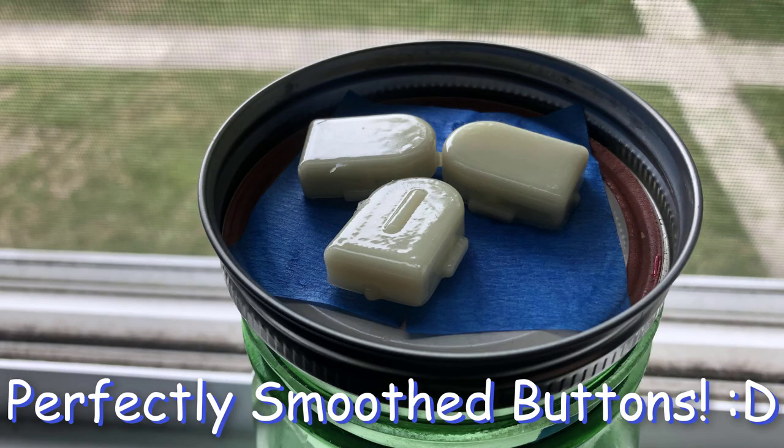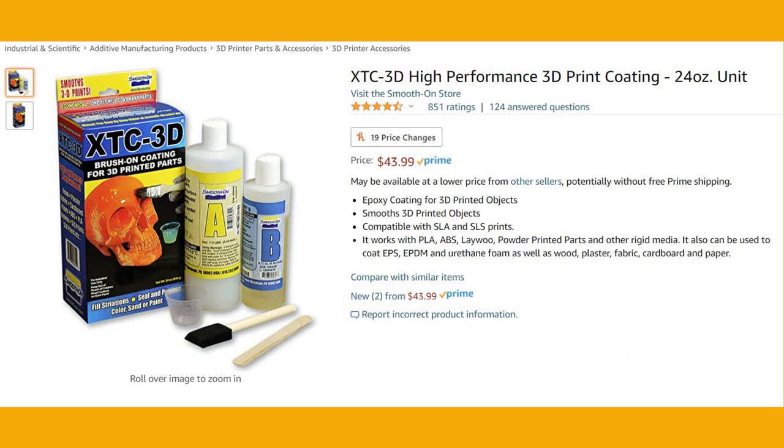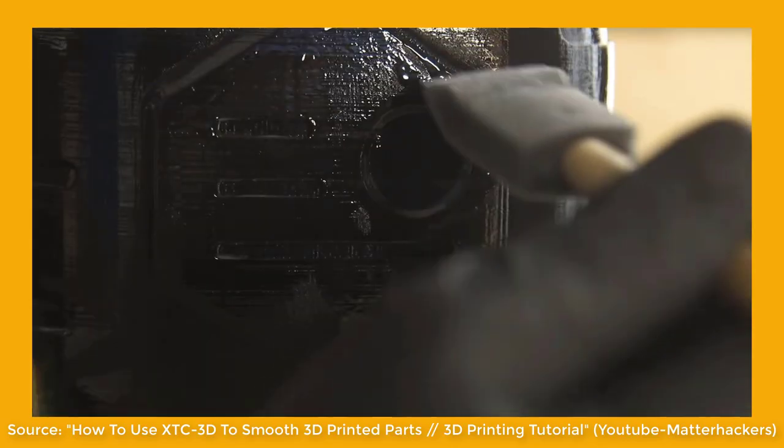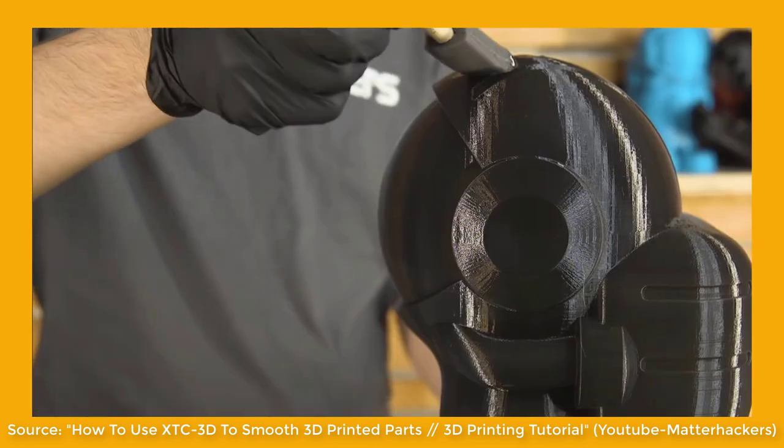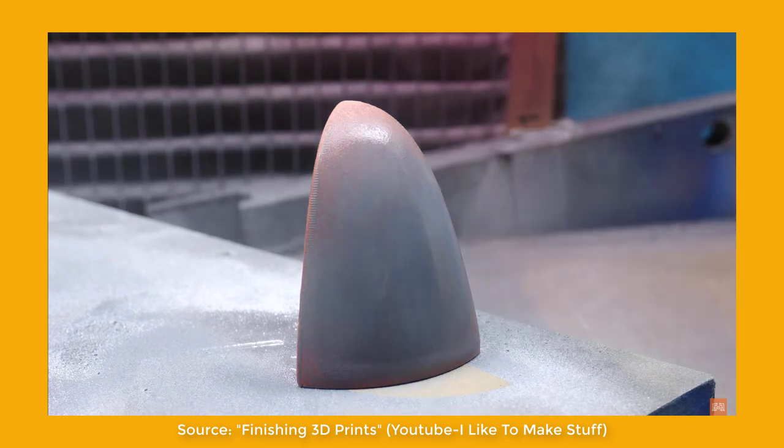ABS is the only plastic that works for acetone smoothing, but there are many other ways of smoothing prints that don't require ABS or using any nasty chemicals like acetone. For example, using XTC-3D to paint on epoxy, or simply just sanding and painting the print.